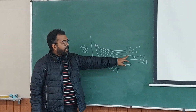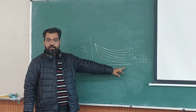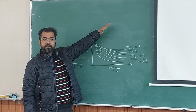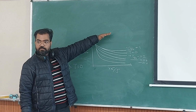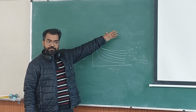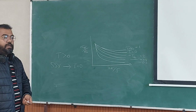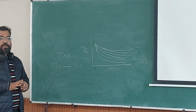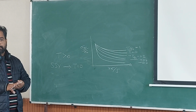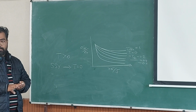If you reach -1 here in negative, then it will go to a very low value. But a positive stress will not create that much effect in the other direction. Okay. So whatever you do, if you are in positive range of T stress, you are not going to increase the constraint to a very high value. Okay, but negative effects are higher.